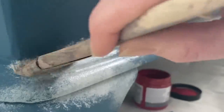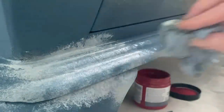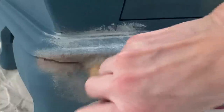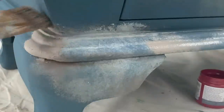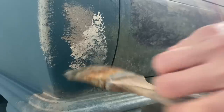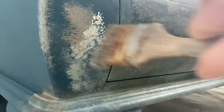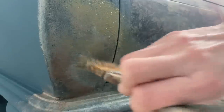The viscosity of glaze is much thicker than using a paint wash, which allows for a lot of freedom and play time. This particular Modern Masters glaze has a really long working time — it takes almost an hour to dry, so you've got plenty of time to play around with your highlights and lowlights. Even when it first seems a bit bold, as you keep tapping it out with that shop towel, it pulls together very smoothly and the color transitions come together seamlessly.